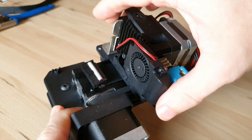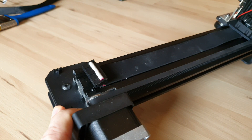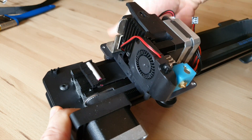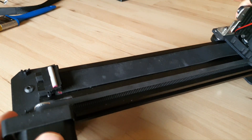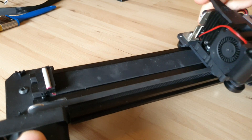So it's best to disconnect your stepper motors when you're doing these operations, because you're going to be doing some testing, some moving, seeing how smooth they're moving. You want to make sure that nothing's too tight. You should be able to hold it and the axis will just fall down on its own — just slowly, controlled. Just the weight of the carriage is enough. This feels nice, feels smooth, no binding.